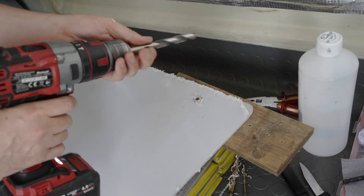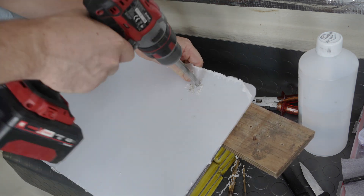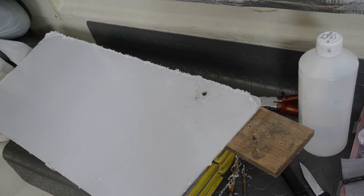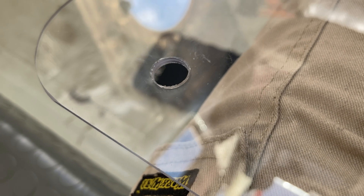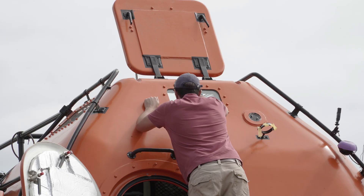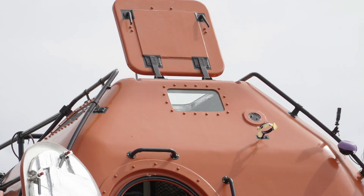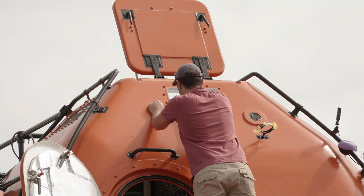I then chose to drill a hole in the lower corner. I said in the last video all the YouTube scaremongers made me nervous about drilling polycarb, but it was remarkably undramatic. Gradually sized up, and finally at 13mm diameter, I deburred and countersunk very, very carefully to finish, as I didn't want to further enlarge the hole with the countersink. I'll keep the mystery of why going until the end. Time to install the panel with a very careful bead of Arbosil around the edge. At the very last moment I carefully polished the inner surfaces wet and then dry, to try and minimise the risk of inviting distracting dust bunnies inside.